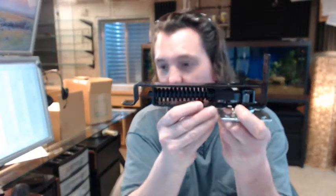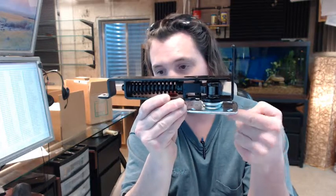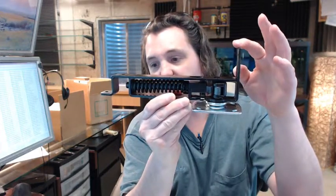Okay. Now, step 3, the first time I looked at that, I thought, oh my gosh, that's very complicated. Bottom line is it's not. You need to make your door fit this. That's all you have to do, and how you go about that is your business. When I've done it, I've tried to use a router as much as humanly possible because it gives a very clean finish. But the bottom line is, from the floor to the top of this prep, it's 3 5/16.